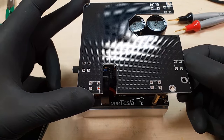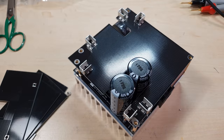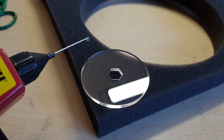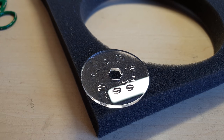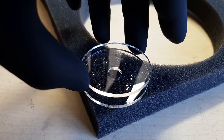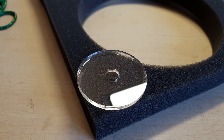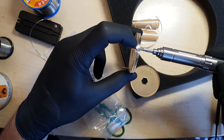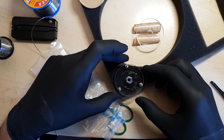The next layer has to be a shield, because there are a few sensitive integrated circuits on the board that want to be protected from the megavolt discharges above. I may not be completely happy with the kit, but just saying megavolt brings back the hype. The primary coil is seven windings made in double-sided PCB traces. To mount the secondary on it, we have to fabricate two plugs from these laser-cut acrylic pieces. The manual doesn't give you a hint on what kind of glue to use, so I'm going with my intuition. This transparent low-viscosity product will partially dissolve acrylic surfaces; if two such surfaces are allowed to cure together, the bond is pretty much indestructible.